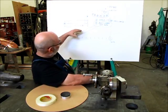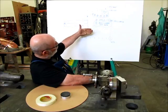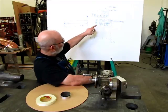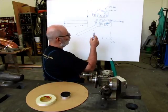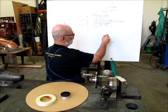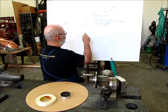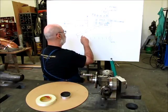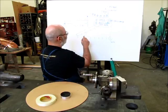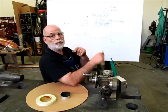So the idea is that this is the tangent, and we're changing that angle until that hypotenuse is equal to that length, okay? You guys see that? Then the cool part is we just transfer these up to this line, okay? And now this space here equals 1/20th of the circumference, without doing any math.